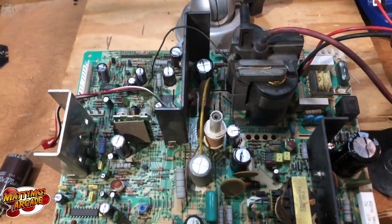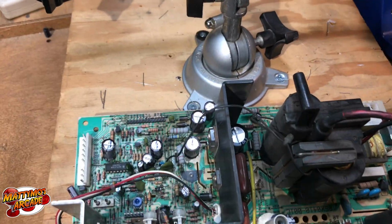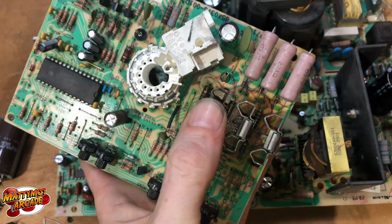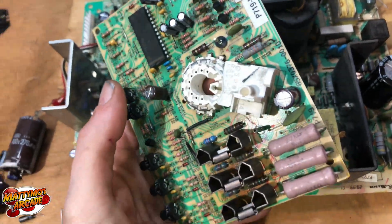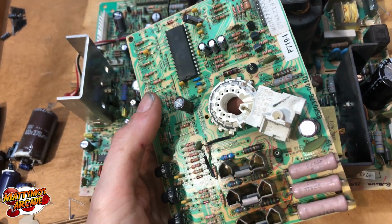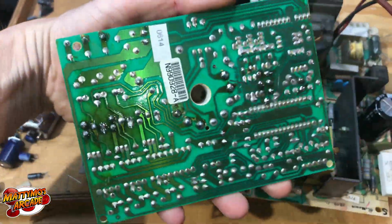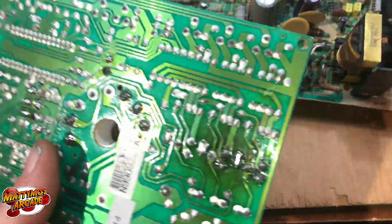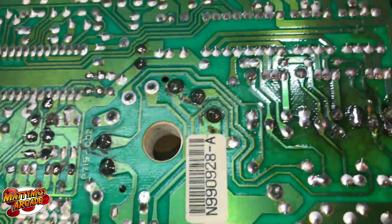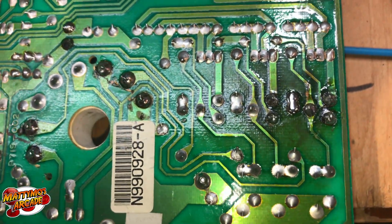But it looks pretty good. I checked the hot, I checked the transistors, the color transistors on the neck board here. Checked all 3 of those, they all tested fine. I did test these, and these 2 here were off a little bit. So we'll see how the colors and stuff look. And if they have an issue, we'll just change the pots. I need to clean this one up too. You see there's a lot of flux and stuff there.